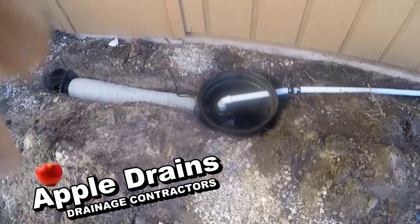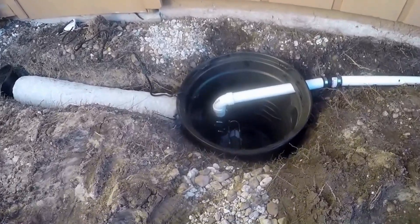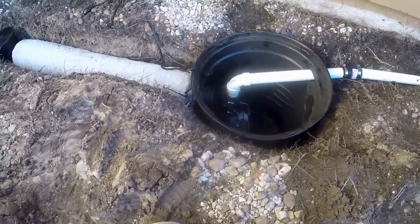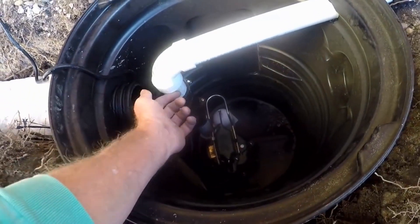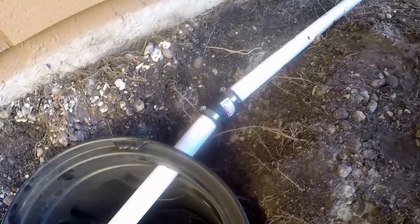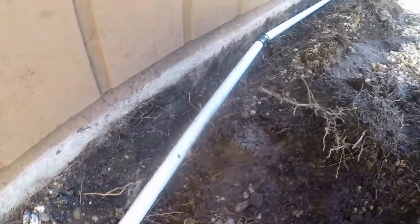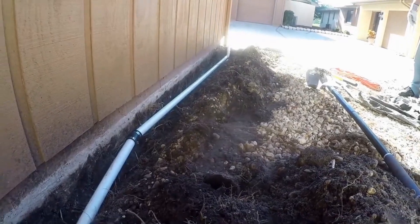Let's take a quick look at the original install. We went ahead and plumbed the sump pump — we added a check valve, we've got a riser that comes up from the pump, through the check valve, then a 90-degree turn. We come out of the pit, use a couple of no-hub fittings that connect, and it comes down so we discharge right at the street.